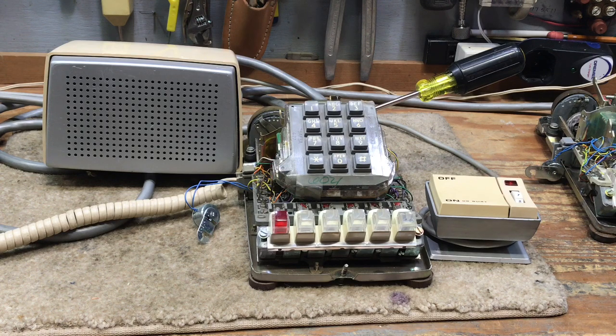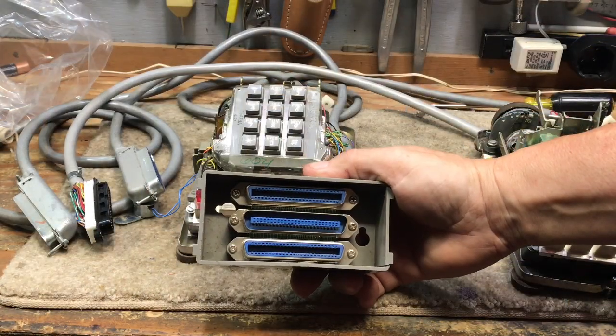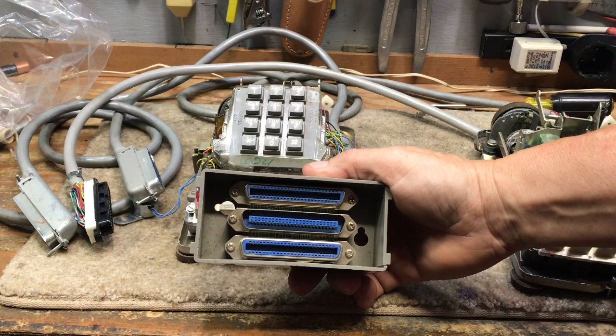I have demonstrated that the 4A speakerphone is functioning correctly on that 2565. So I will show a bridging adapter and what happens when you try to connect two telephones on the same cable without undoing some leads in one of the two telephones. I have in my hand a bridging adapter — installers generally referred to these as a CPC, which stood for connector plug connector.